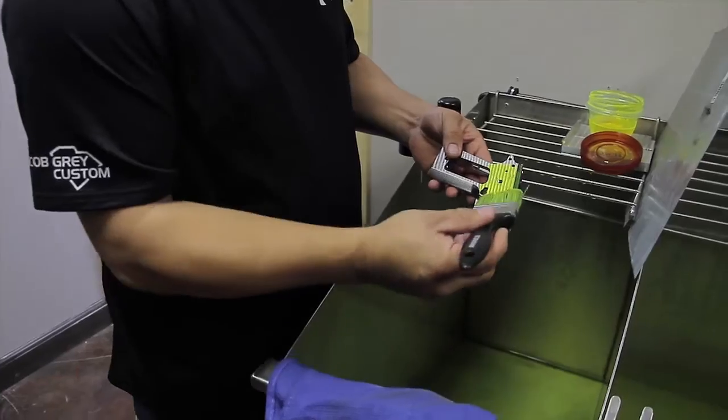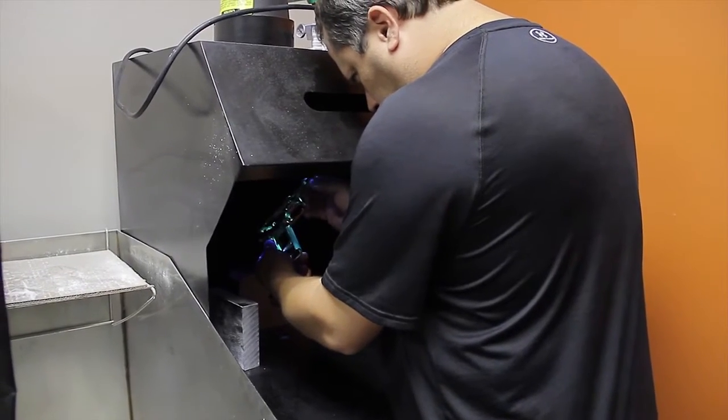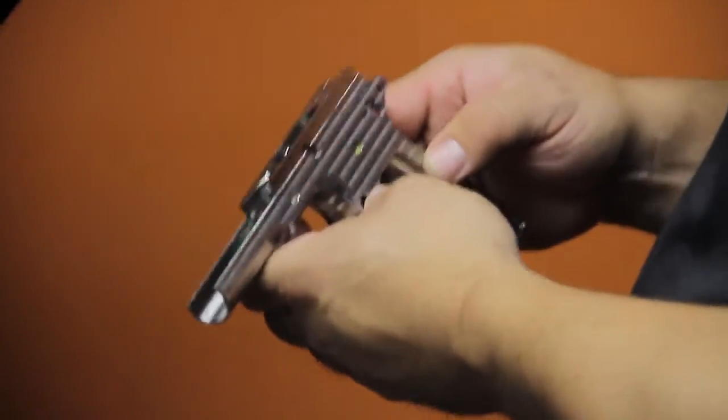After the manufacturing and quality control process, the gun then goes to the fluorescent penetrant inspection line. There, it is put under a test which allows us to see stress and cracks in the gun that you would only see after long-term use. We're able to see that now using FPI technology.